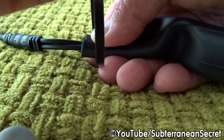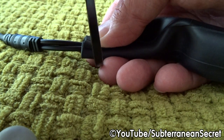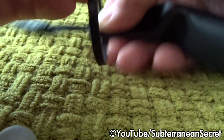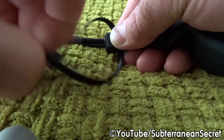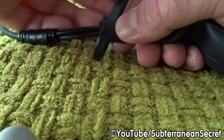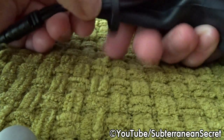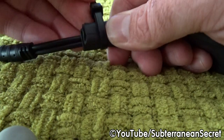It's a little fiddly doing this, so you may want to practice first. I mean, there's enough inner tube in one inner tube packet for at least 5 or 6 joints, I would say, easily. So once the cable is over, pull it into place. At first I would just gently, don't do it too tight at first. Just make sure all the rubber is evenly folded.